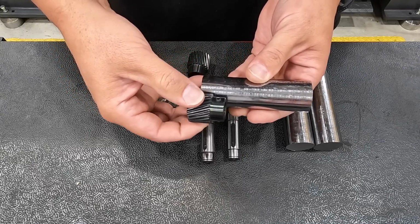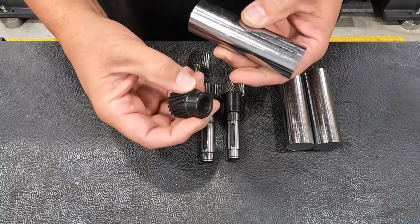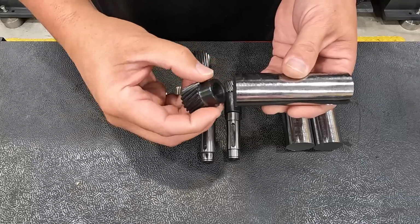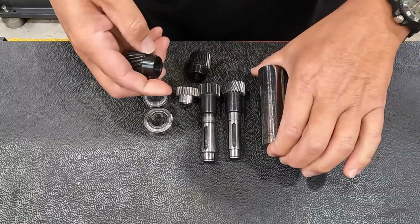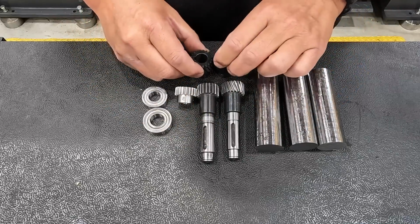We're probably going to make a slightly interference fit on these gears, and then with a key, and end up dimpling the two spots for the set screws to help lock them on there as well. Okay, but simple off-the-shelf parts that you can get without having to machine these gears.